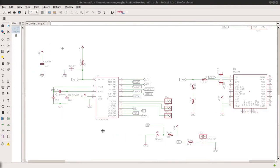I would like also to mention that it was not a good choice for me to use this specific microcontroller. The ATtiny 2313 has only 2 kilobytes of flash memory, 128 bytes of RAM, and 128 bytes of EEPROM memory. So I had a bit of a struggle to store all the ASCII characters needed. For now, I only stored the digits and a few special characters to be able to show the clock.